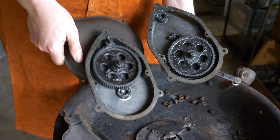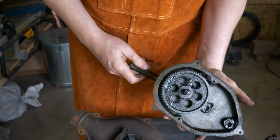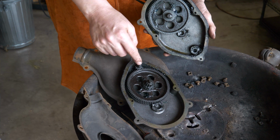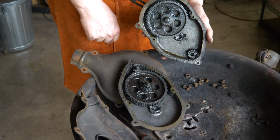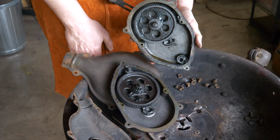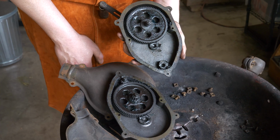So we can see we've got the crank here. We turn that, that's going to spin the gear. That is attached to this gear here, which in turn turns this little gear, and this is the bar that the fan is attached to. So you get a little bit of improvements in mechanical force with the gears in there, and dead simple design. Really nothing complicated about this.